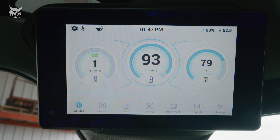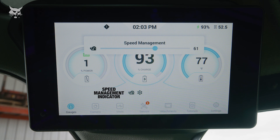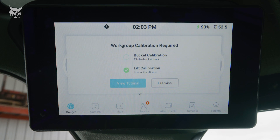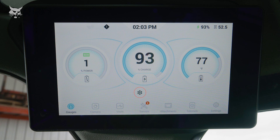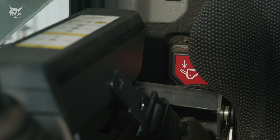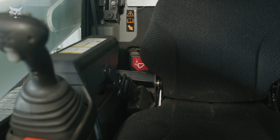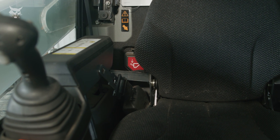On the right side of the screen, the Battery Temperature Gauge shows the current battery temperature. At the bottom, you can quickly see whether speed management is engaged with the Snail icon. Work Group Calibration will help if you notice a slow lift and tilt response. This icon lets you know if Work Group Calibration is needed. This can be necessary if you're using the Lift Arm Bypass Control, a backup that allows you to lower the lift arms if they can't be lowered during normal operation.